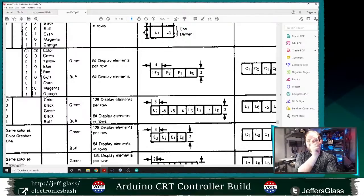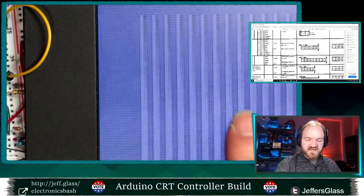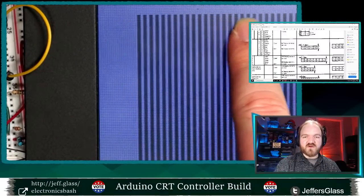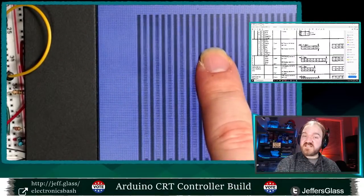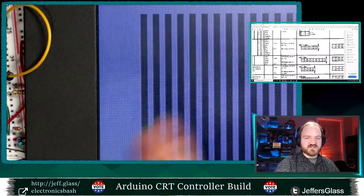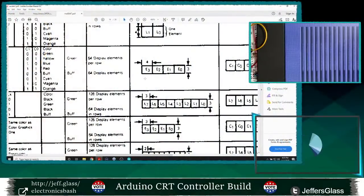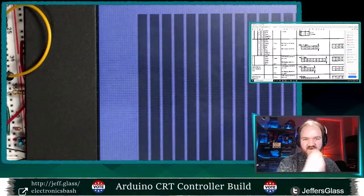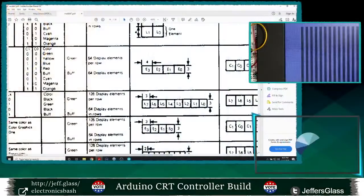And we're going to repeat those elements chunk by chunk over the course of a single line of these chunks. Then we would skip down to the next line of the screen, and the next set of bits that we look at would define this. And again, because we are not changing the data particularly rapidly, that is going to be the same repeated set of pixels all the way across the screen. But if we were changing these bits rapidly, which I hope to do in a little bit, we would be able to have different collections of pixels at various points on the screen. And these would be different colors. Right now they're showing up as different brightnesses, which is still kind of interesting.